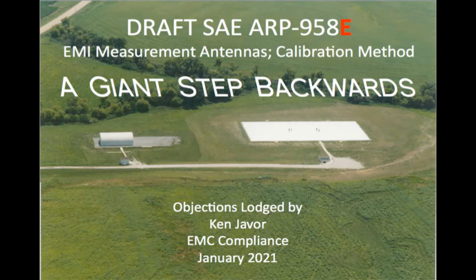So now, getting into the presentation here. ARP-958 covers the calibration of antennas used at 1 meter separation from the test sample. This makes it a near-field measurement, which is key to much of what will follow. Examples of such use are CISPR 25, Mil Standard 461, and RTCA DO-160 for commercial aircraft. This presentation is about a problematical change in the subject revision to this half-century-old document.